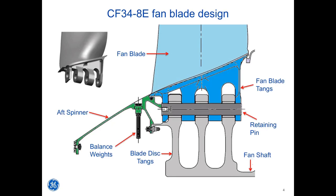The fan blades are designed to rock back and forth around the retaining pin by about 2mm in each direction. During early morning pre-flights when the ramp is quiet, you can often hear clicking from the fan blade assembly as the fan gently rotates in the ambient breeze. The clicking is caused by each blade's center of gravity falling by 2mm around the retaining pin as the blade passes over top dead center. To help the fan blade rotate easily, the retaining pin is lubricated periodically by your airline's maintenance team.